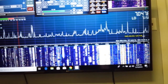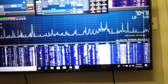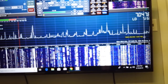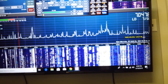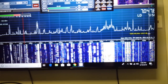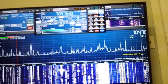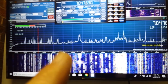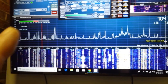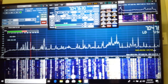To control the transceiver from the software, you need an interface called OmniRig. It's a small piece of software that communicates with the transceiver via CAT commands. Whenever the transceiver is tuned manually with a knob, or if we change frequencies on the SDR, they are synchronized and follow each other. OmniRig is your interface between your SDR software and your radio, and that is what most of these setups use.